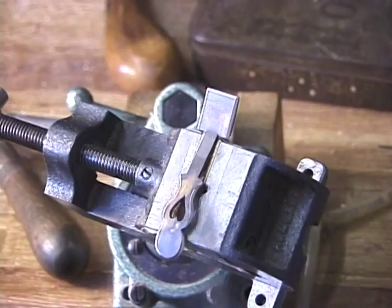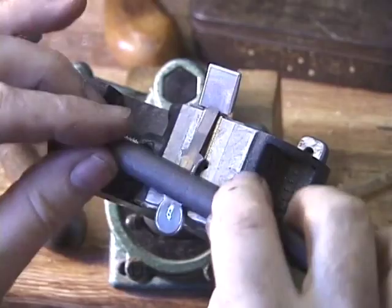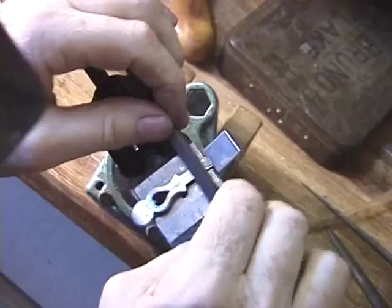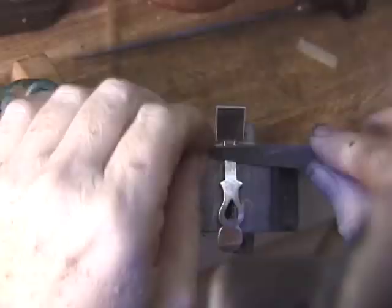The surface looks flat, but when you draw file it, you can see that it's not really flat. You see the high points there being taken down to get a sweet surface on the keys. First with the file, and then with other finishing techniques. These could be oil and sandpaper, some steel wool, or some silver workers prefer to use the burnisher as the final operation.